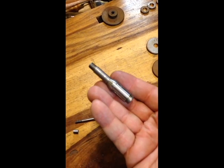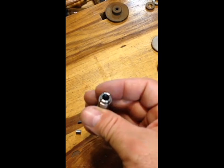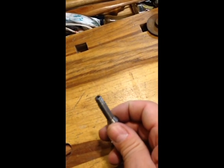Just started with a piece of 12L14 steel, about a half inch in diameter, chucked it up, and very carefully cut this. It's spread with this little shaft that fits inside of it once one of the gears is actually popped onto the front. That's an exact three-eighths short section, and a nice square shoulder that guarantees these are nice and square if it gets pushed up tight. On the back of it is a little circular nut, and the circular nut is actually slightly smaller than the diameter of the threads that are on the back of the collet itself, because this has to go into the headstock, and the drawbar has to be able to go over the little circular nut in order to get to these threads. So the whole thing just slides together very nicely.